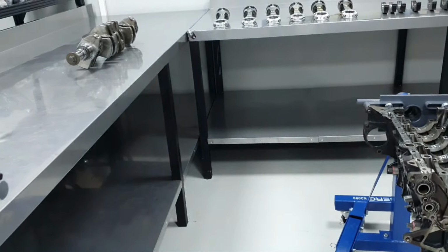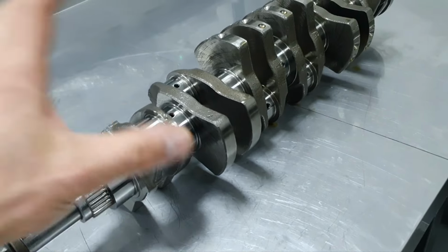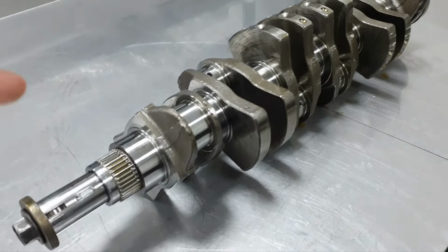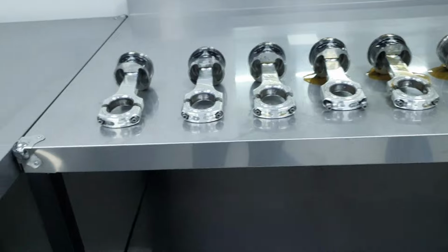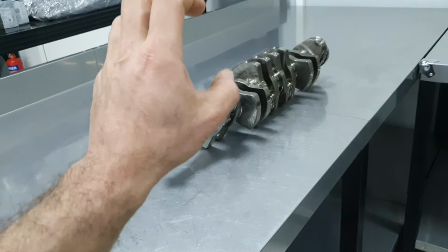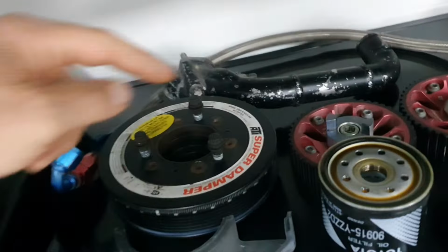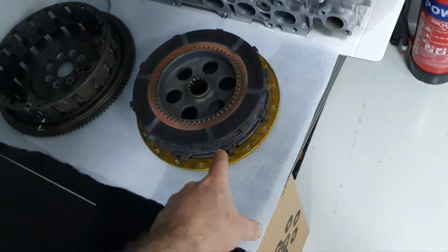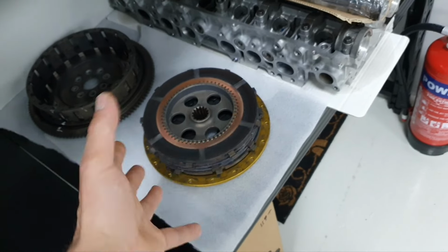Now, what I'm trying to say is that you have one crankshaft that nobody balanced. This crankshaft is balanced for the stock connecting rods. It's a stock crankshaft. It's not a crankshaft that's been balanced with the billet aluminum connecting rods, okay? So, one stock 2JZ crank. You have one very good damper pulley, ATI, if I remember right. Yes, it is. Fine. And then you have a flywheel and clutch. You get my point? You see where I'm ending up?